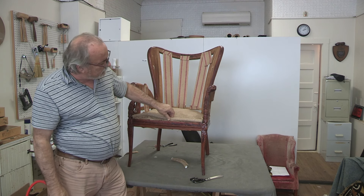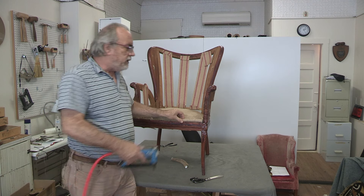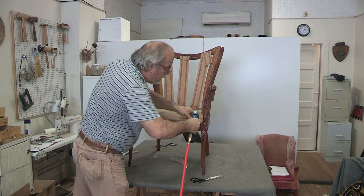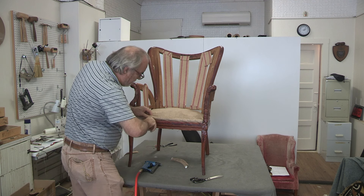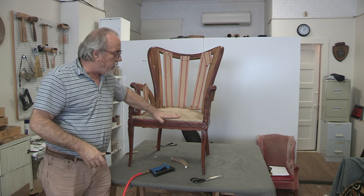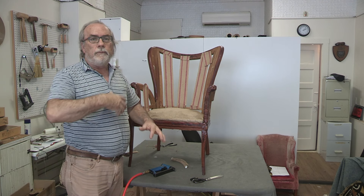I'm taking a medium-sized edge roll since we're not doing the full horse hair treatment. You're going to staple this down just a little bit over the edge, about every two inches, then come to the front and get a couple of staples at the ends, angling the gun like so. You can tuck in that little piece of twine from the spring — that tightens it up even more. Very important: you don't want any play on this roll. Any play will go right up to the fabric and wear it down. My goal is to build this to last 100 years, or three or four upholsterings.